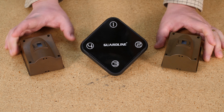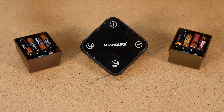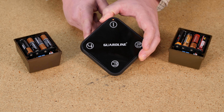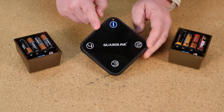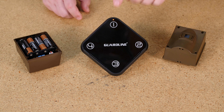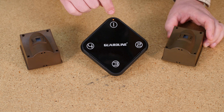Let's say I've just paired up my first sensor. I'm going to go in with my receiver on, enter learn mode, go to Zone 2, and activate this sensor — and I see that Zone 2 flashed. So I'll turn it off and turn it back on. Let's test it out. Zone 1. I can see that this sensor is paired to Zone 1, and I don't want it paired to Zone 1.